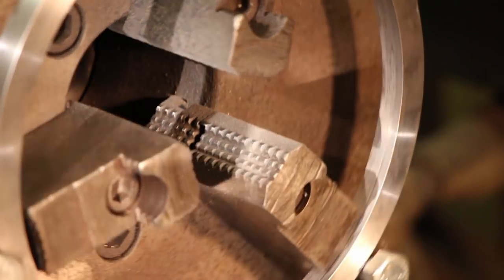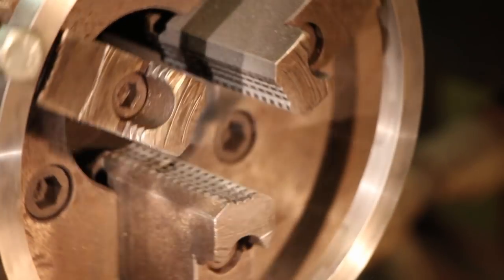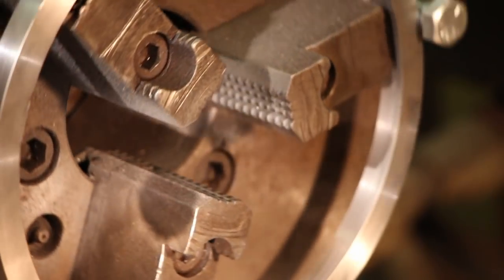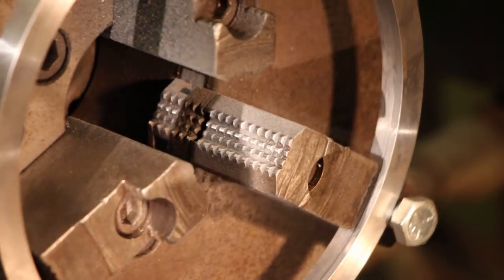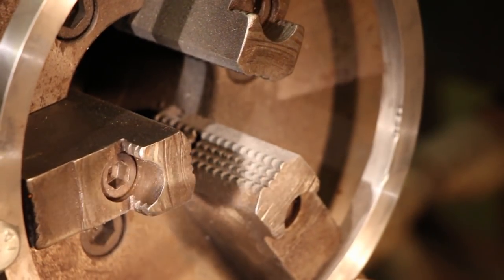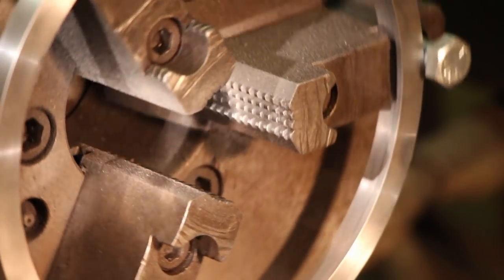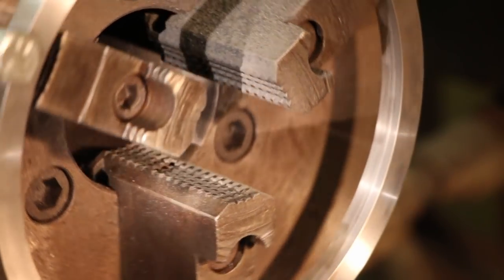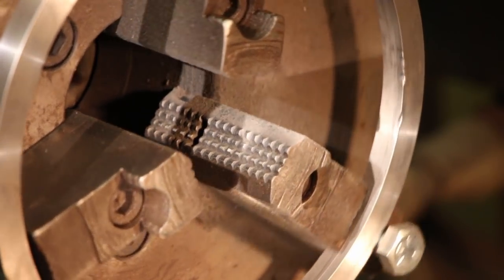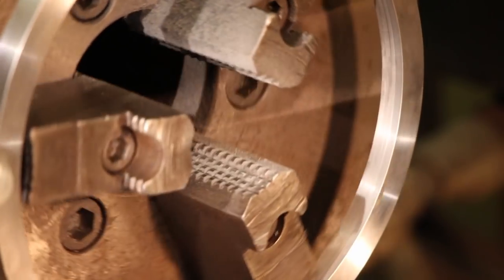I've got you zoomed in close here. I want you to see — I've got a little flashlight shining on there, and as I turn this you can see the pads in there just shining, which is exactly what I want. We've gone in and basically kissed each one of those with the grinder, and now hopefully all of those pads are the same diameter. When we chuck this piece back up and put the indicator on there, I'm expecting to see much less runout than we had before.